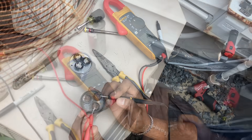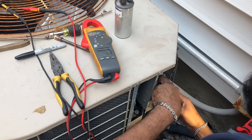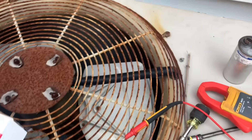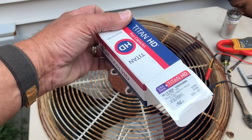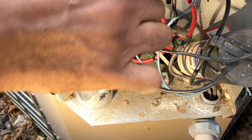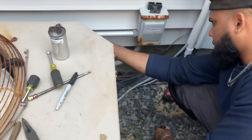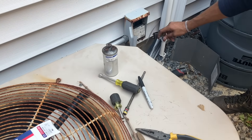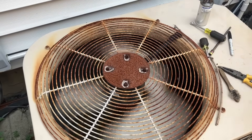Now we're putting the capacitor back into the electrical compartment, securing it with the band iron, and connecting our wiring. We're placing the sticker so it faces outward so the next person who checks this unit will know — there's a Sharpie on it with today's date, date of replacement, and the size so you don't have to take it out. As long as all the wires are snug you're good to go. Apply power — and there's a reason I had you stand and do it that way, because if you're grounded, your body knows it. Oh look at that — you fixed it!